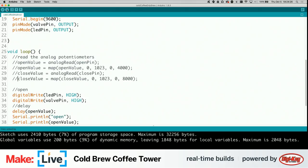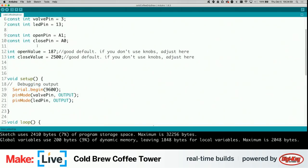All right, so if we see on that LED there, which I guess is probably a little bit too bright for that LED. Let's wind this. So this little LED here indicates that it's opening briefly for roughly every second. I'm actually going to go into this code and change this value so it's a little bit easier on the voltmeter to read. Set the open value to 2500. That's 2.5 seconds, and then it'll be closed for 2.5 seconds.